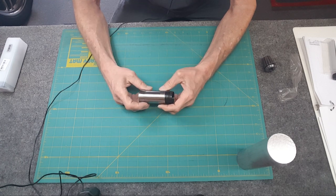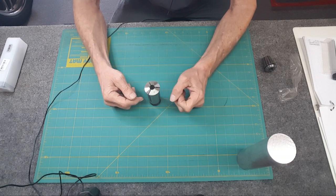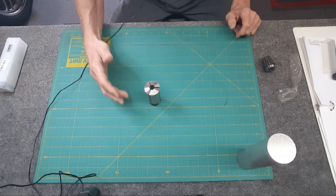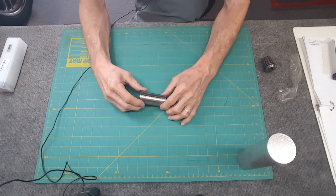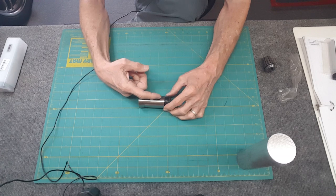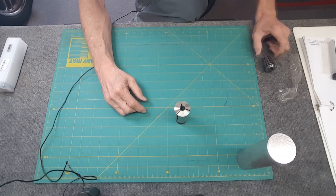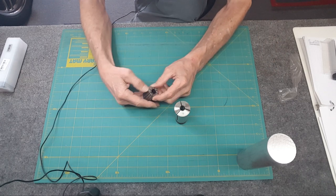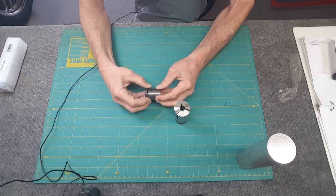And you don't get any wobble. But 9 times out of 10, I'm trying to hold something that I'm going to grind. I'm making a bit or a cutter or a boring tool or something, and it's not the exact size. So what happens is the back of it wobbles. The front is held, but the back is wobbling. I like the ER32s because you can tell the way it's cut here that both the front and the back collapse on the part.